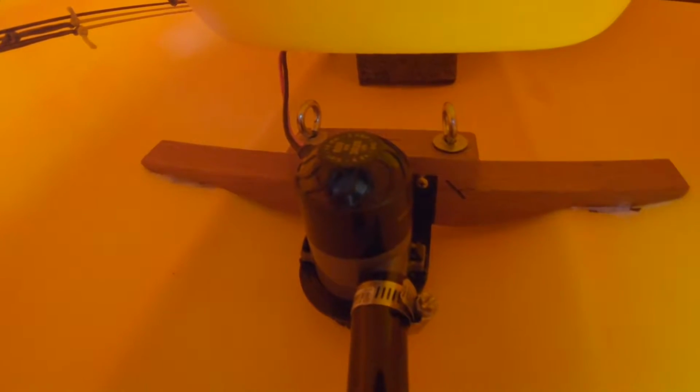And then the bilge, what I ended up doing is using teak scraps from an old chair that I salvaged. This cross member was profiled using clay. So I rolled up a clay Tootsie Roll, whatever, and let it dry in that shape. But on one side of it, I made it flat so I could trace it onto poster board and then make my template and use my bandsaw.